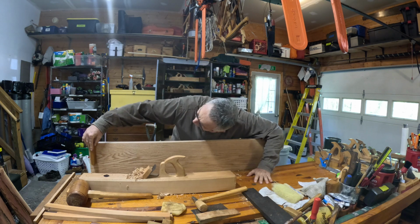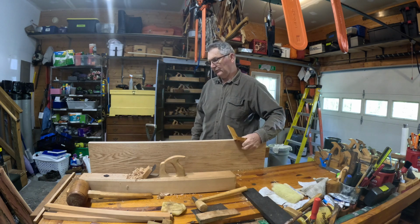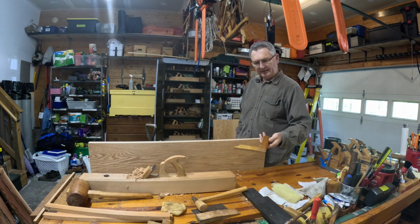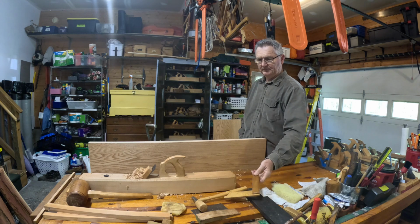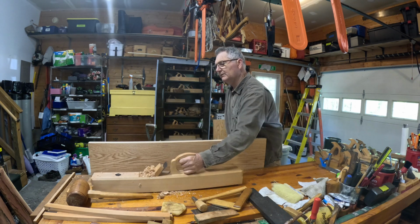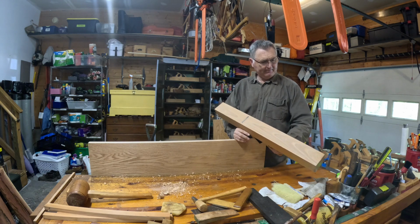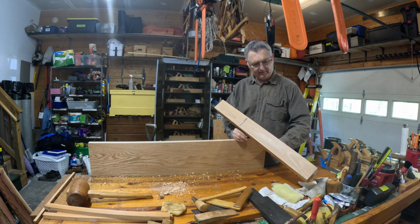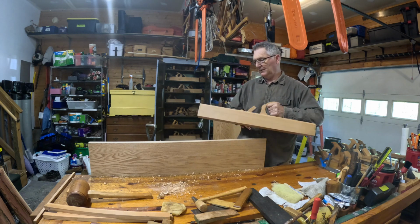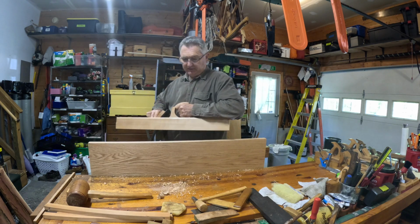I mean, I've done enough work exclusively using wooden squares to know they're fine. They're perfectly accurate, or good enough for traditional woodworking. They're lightweight, they're fun to make. This one's made out of just hard maple. They stay true. You can tune them up just like you could tune up the wooden planes endlessly and quickly. This plane here maybe sat for up to 2 years not being used, and I got it tuned up on a strip of sandpaper on a granite slab in 3 minutes. You can't do that with a metal plane.